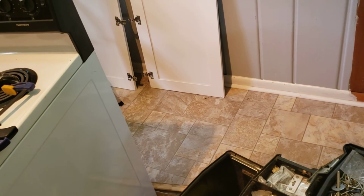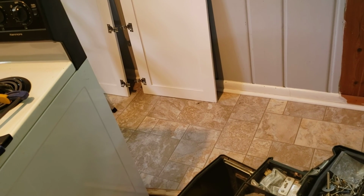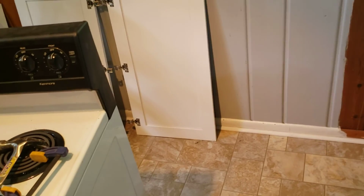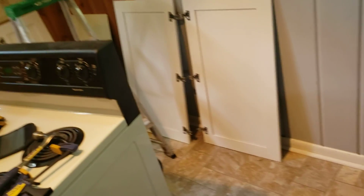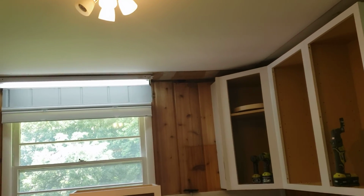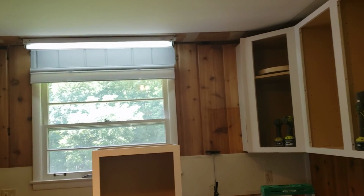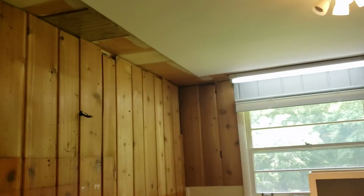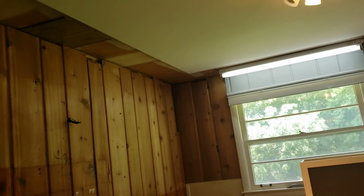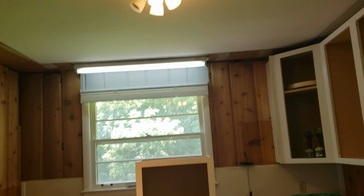It's going to be 2 pieces of 696 solid stock, S6S96. It's going to be 2 pieces of 642 wall filler, and on the top ones, it's going to be 3 pieces of S3S96 top stock. That'll give us the finished molding we need from the store to wrap around, and then they'll actually have their painter paint that molding to match.